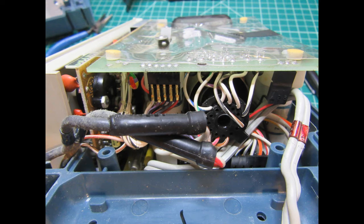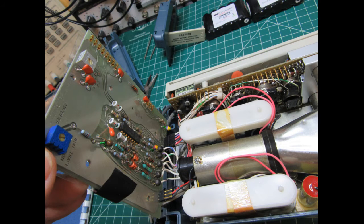The bottom of the scope circuit board assembly, which is at the top of this photo, is the deflection circuit board. It plugs into the adjacent board on the left of this photo with two pin plugs, one at each corner of the board. You have to lift the board up a little bit so it undocks from the two battery packs, which have pins that go up into holes in the board. Then wiggle it loose to disconnect those two pin connectors, and the deflection board can swing up to get it out of the way.